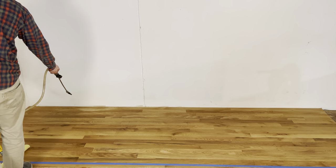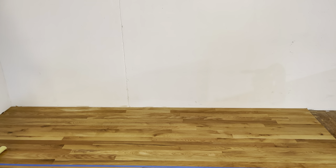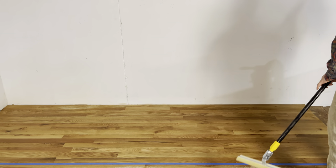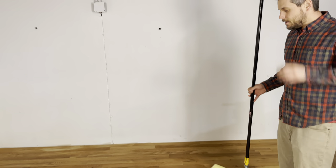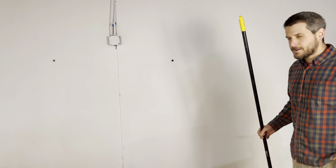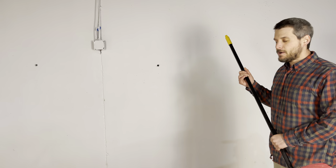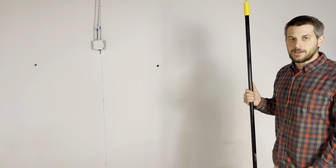You'll see back here it's already drying, which is fine as long as it's been wet one time. Not too much water. We're going to let this sit overnight and then the next day we'll stain. Typically we do this at the end of the day. That's how you do it with a sprayer and a t-bar — it's the quickest way to go. You can also do it with rags and I will show you how to do that in the next video.